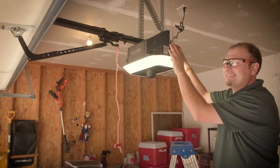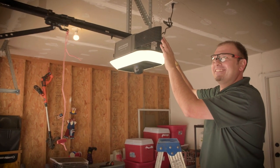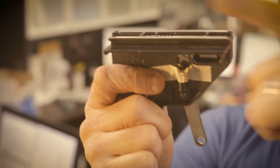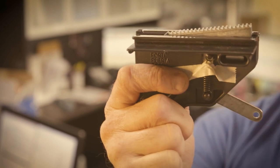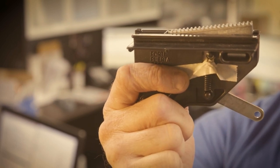This is a trolley and typically these ride on the rail of the operator. When you pull the red cord, what you're doing is you're disengaging the trolley from the operator itself. By pulling the red cord down, you are now free to move back and forth. When you re-engage it, it lifts a set of teeth up that re-engage into the operator itself.